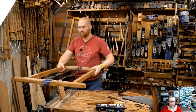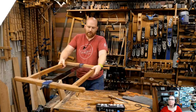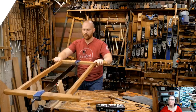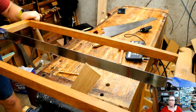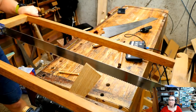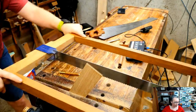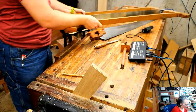Let me show you starting this frame saw. I'm going to set it right on that line. The problem is I can't lift the saw up the way I could with a hand saw — with a hand saw I'd scratch the top with a pull-back stroke, but that lets the saw bounce around since nothing's controlling it. With this I set it in place with one clean stroke — just four or five teeth into it — and that quick jerk forward locks it down in the kerf. Now I'm cutting down my line a little ways, and just like that we're into the board.